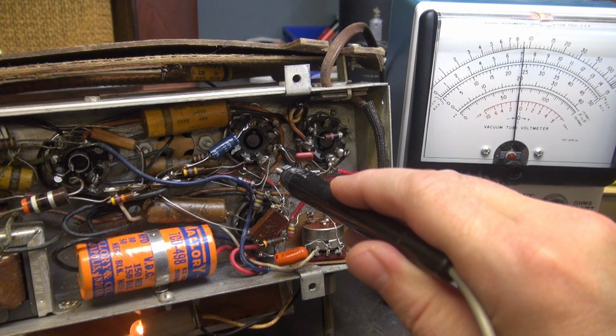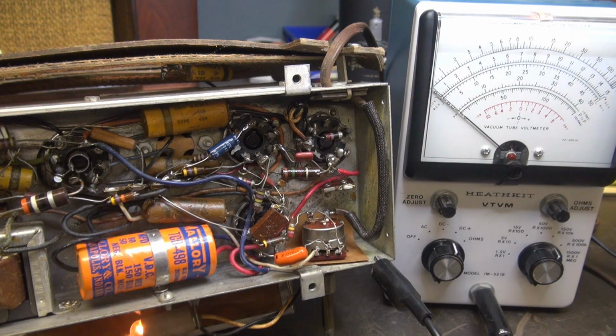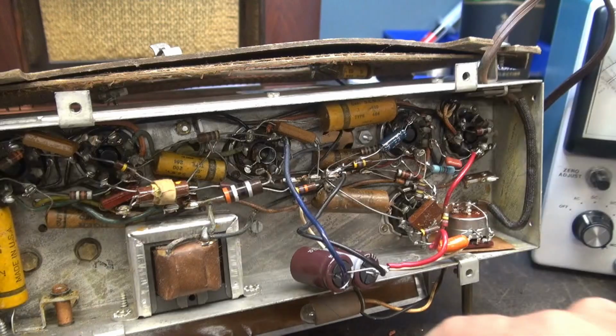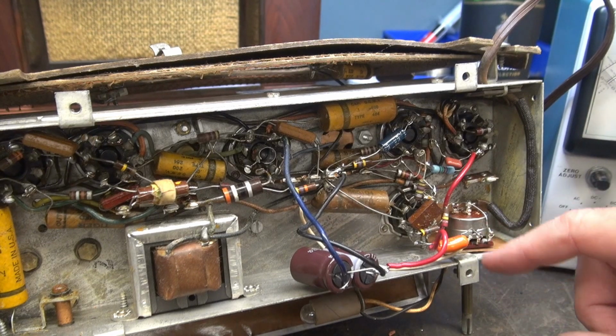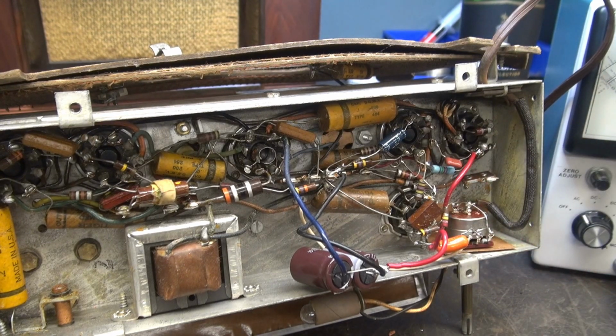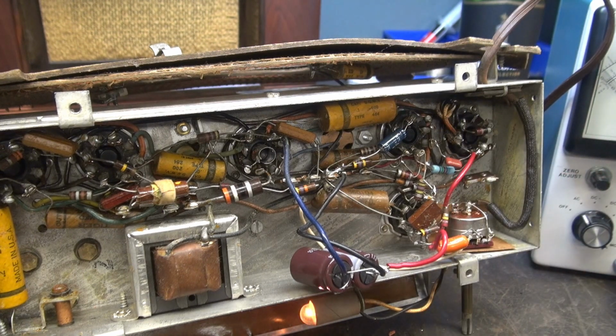And this voltage is dropping and jumping around. And guess what that goes to? The filter cap. We're going to change out the cap, change that resistor, and see if the noise goes away. I've changed out that filter cap. Got some fresh ones in there. They're just kind of hanging, so yeah, it's kind of dangerous. The old sweaty resistor is gone. Let's plug it in.